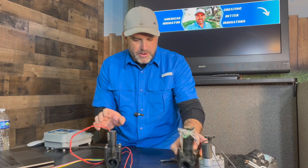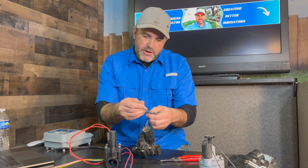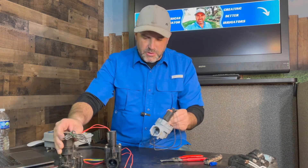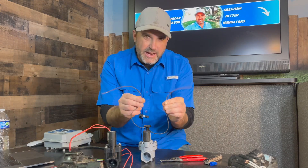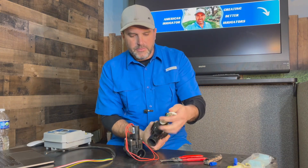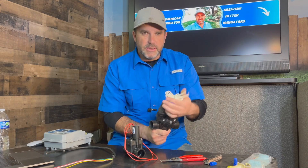Let me show you a different manufacturer. This one has got black wires but they can both have white stripes, so there is no difference between these two wires. This manufacturer has both wires in black, and that's not indicating any kind of difference. Some have both wires in white — same type of thing. As long as one goes to power and one goes to common, it's going to work.